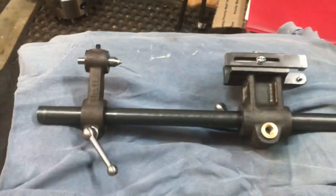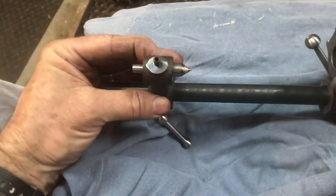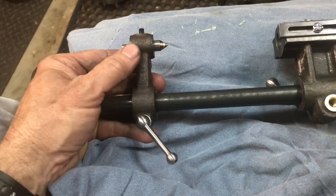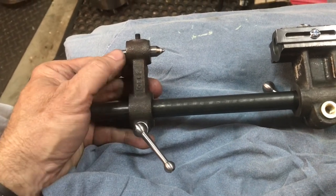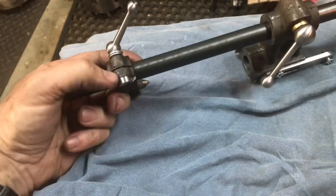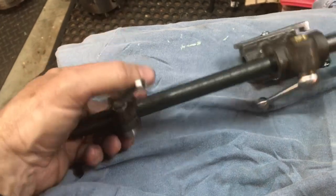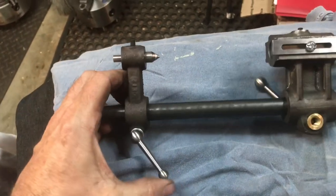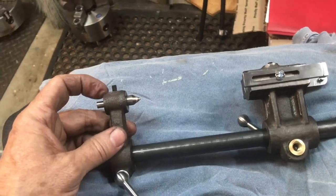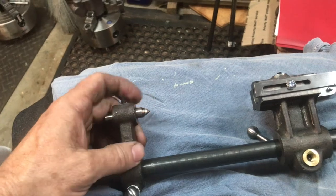This will be a short one — just the setup for boring the two holes: the 5/8 inch hole in the base and the 3/8 inch hole in the top. I split it the conventional way, made a little lock bolt, and I've got the small ball handle on there. I drilled and tapped 10-32 at the top to hold the center.